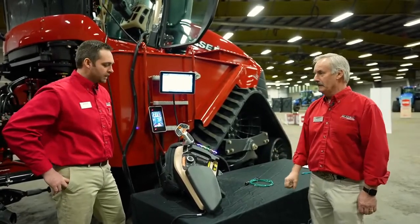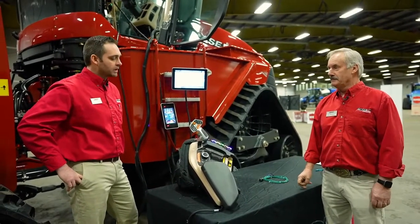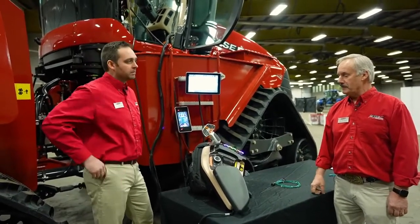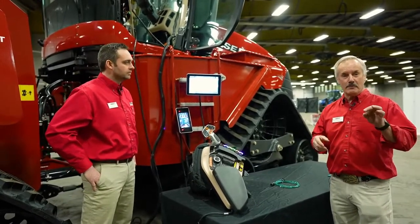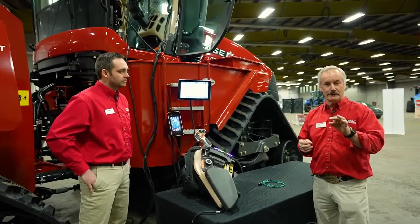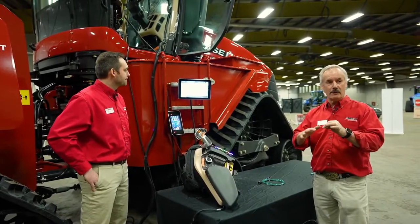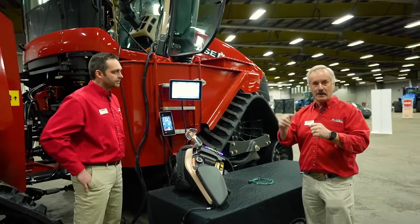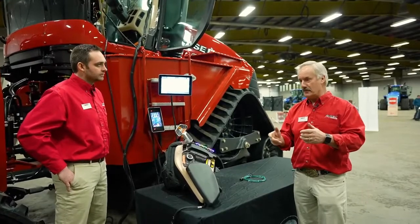Well, that's a great analogy, Louis. Thank you. And again, we're trying to maximize the efficiency of the hydraulics and put the oil where it's necessary and reduce it in areas where we don't need as much. Because one of the things that'll happen, if I'm trying to force 30 gallons per minute through a 10 gallon per minute orifice, what's going to happen is the hydraulic system is going to go onto what we call high pressure standby. And when it goes into high pressure standby, then it's going to jack the pressure up, and all it's going to deliver is going to be 10 gallons per minute at 3,000 psi.